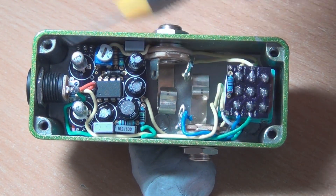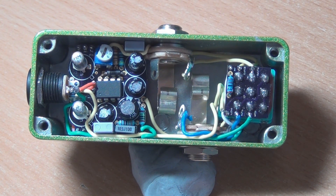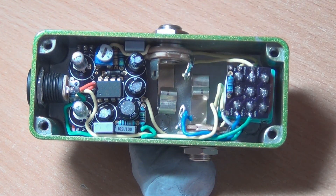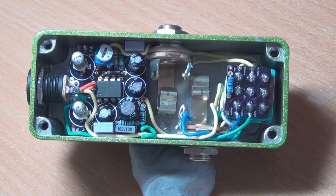You've got the bias control there which is just a trim pot. I've put 20K in this one and it probably would be better to have 30K — thinking about leaky transistors, you just can't get to 4.5V with 20K. I think 30K should fix that problem, so if I build another one I'm going to put 30K in and check it. I'll update the bill of materials so it says 30K as well. You also don't need low profile caps because you're not going over the top of the low profile jacks.